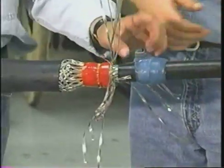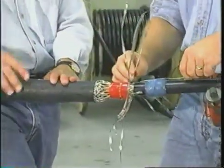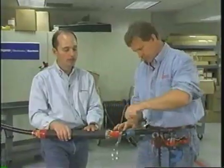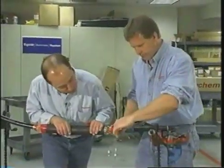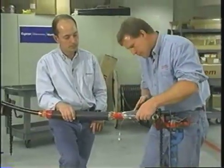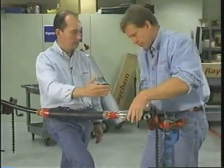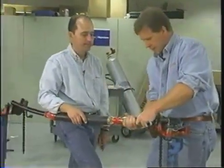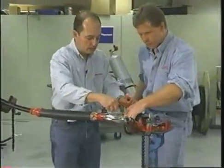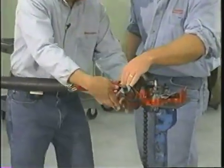This is new — we've never seen this in a medium voltage installation. It's only rated up to 600 volts, so it's used only for a jacket seal, not in a medium voltage environment. Now you're folding the flat straps down evenly. If you had a copper tape shielded cable, you'd bring a solder block braid out the same way and put it in the gel. You basically want to bring the gel underneath the flat straps, then tie them down with a piece of tape — and the red tape comes in the kit.